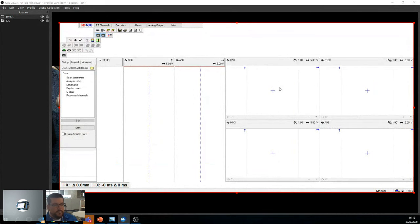Okay, so now I'm good. Here I see my PC and my box are connected. That works out well. I'm going to grab my probe. Step 1, look inside the cal tube. Make sure wherever you null, there's no defect. Because if there's a defect, you're going to change the null point. And change the null point means that you're not going to get the right information.